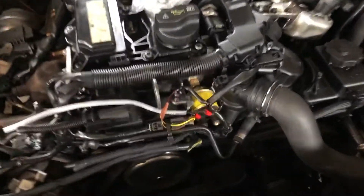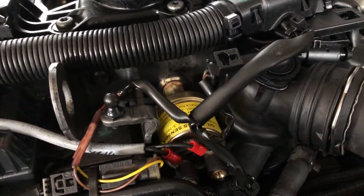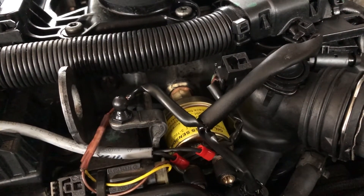There is actually a service connection. I found it in one of the manuals — you'd be able to hook up just a normal pressure gauge to that M12 times one and a half right there.